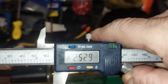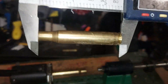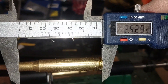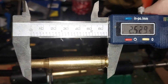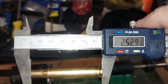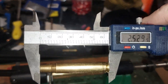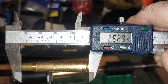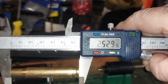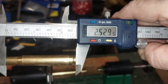I've got some 270 brass, which is basically the exact same as 30-06 brass, except it's necked down to .270 instead of .308. When you expand it and stretch it, it becomes a little long. So my 270 brass, now converted into 30-06 brass, is measuring 2.529 inches. So we've got to shorten it up.